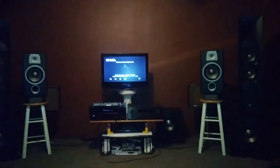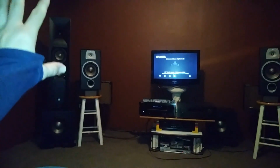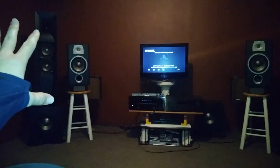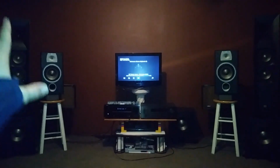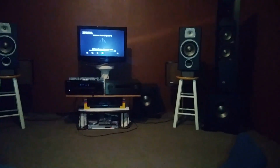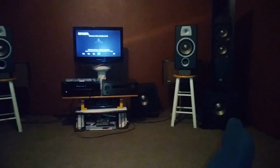It's doing something, but then you put it in direct mode, and there's more bass because these speakers make more bass. When you put it in direct mode, it's just playing full range to the speakers, no DSP, no subwoofer. You get more bass with just the natural bass response of the speakers, no equalization. It seems paradoxical, but that's the way all these speakers are with their subs. I've tried various combinations of those speakers with those subs, and these subwoofers are a sealed box, so they sound like they have less bass than something that's ported like this.